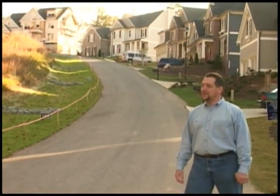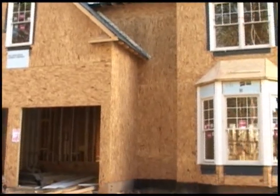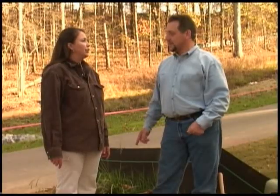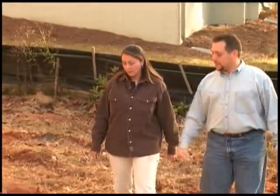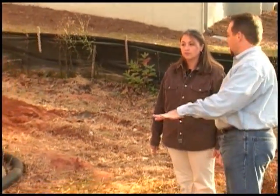Our homeowner has shown up. I'd like to go over what we're trying to accomplish with putting in your low-pressure sewer system. The selected grinder pump station meets the daily and peak sewage flows from the home to specify the correct pump station size and features. The site has been assessed for the correct power source and its rating, and to determine the control panel model to be used and any needed special features. It's helpful to gather details about the sewer system, such as the location of the gravity line, its elevation, size, type of pipe, and unique features of the site. Finally, discuss the location of the new grinder pump, control panel, and connections. You will also need to obtain the required permits and meet with subcontractors to coordinate their work and delivery of materials, such as backfill if necessary.